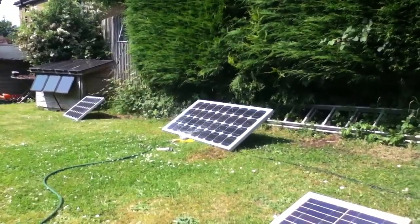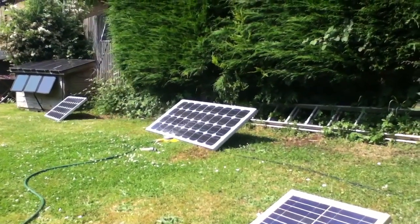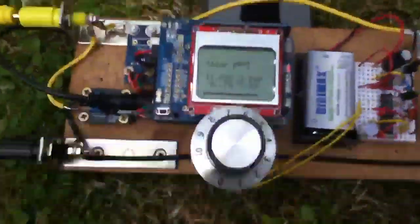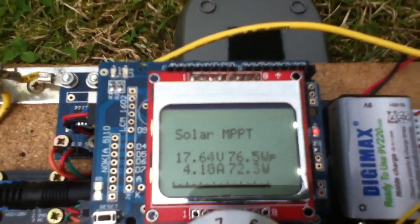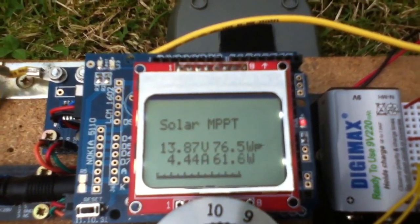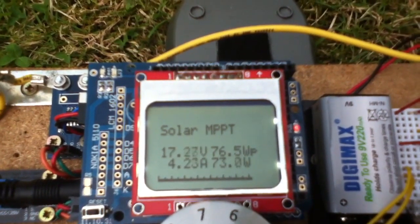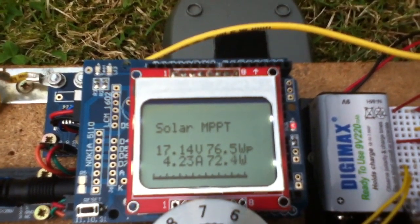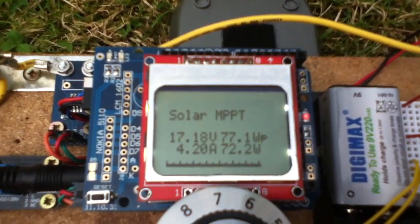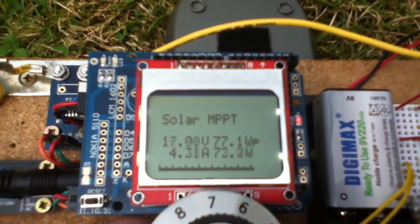The ambient temperature is pretty high today, so the panel was very warm, and solar panels drop their voltage when warm. But now with water all over it the panel is cold, and it's making a really big difference - the MPPT function is having a big impact. It's 73 watts versus about 62 with a direct connection. With a cold but very sunny day you can see the advantages of MPPT are quite significant - that's an extra 10 watts on roughly 60, which is maybe 15 to 20 percent. You just don't get that when the solar panel is very warm.